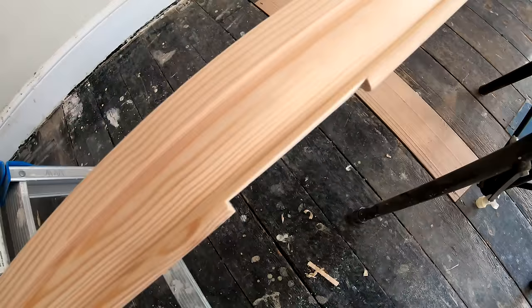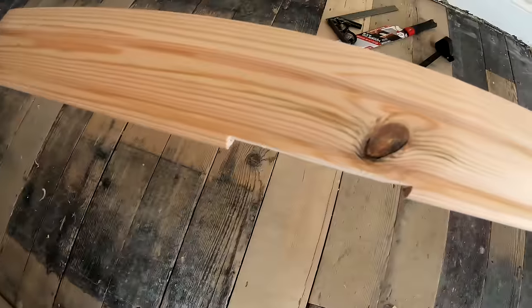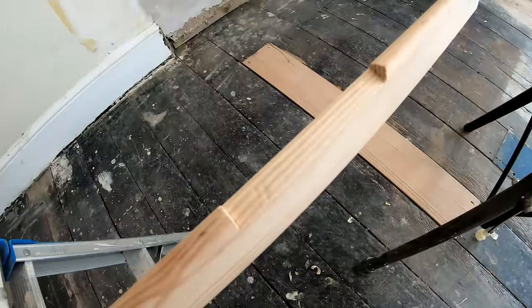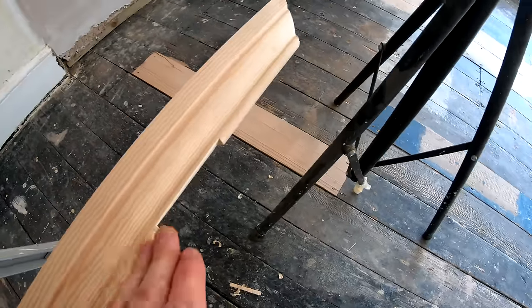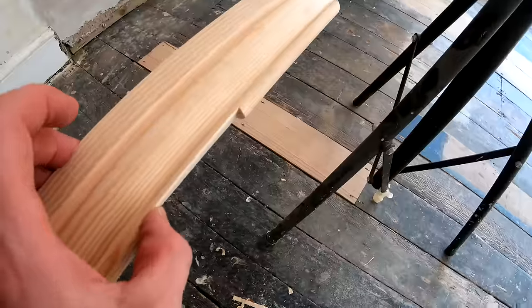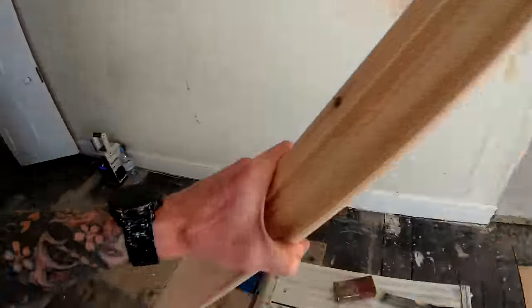I've just cut out the little notches for the hinges, and I've also cut a bit of a chamfer on them as well - slightly angled in - the reason being that the hinges are obviously rounded so they'll just sit in snugly behind them. Let's go and try to see if it fits. Beautiful - that sits nicely up to the edge of the lining, and that one as well. I'll get this fixed in and then we'll get the head and the other leg on.